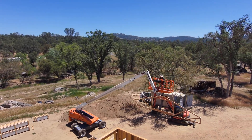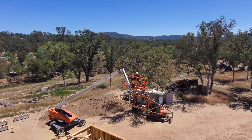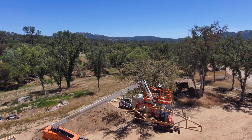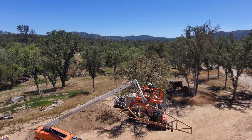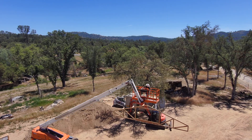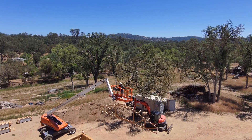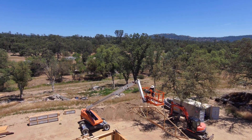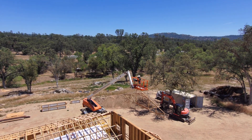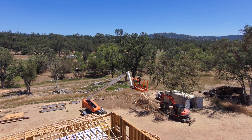As far as the trusses go, you can see the roof pitch across the top has a 4/12 pitch. And then it has kind of a big square in the middle — that is for our attic. It's four feet high and eight feet wide, so it's not a very big attic. But since it's a small house, the space we can get up there we can use for mechanical equipment and storage as well. It's kind of long-term stuff that we've been keeping around but can't quite seem to get rid of either. So we'll be able to make good use out of that space.